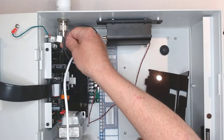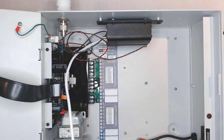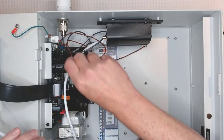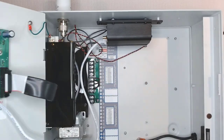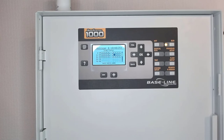Then connect the modem power cable to the power board at the port labeled COM3. Now take the other end of the ethernet cable and connect it to the port on the back of the display board. You can use the included gray cable clip to secure it if needed. Power the controller back up and the hardware installation is complete. With all communication methods, make sure the antenna and ribbon cable are connected before powering up the controller. Powering up without an antenna or ribbon cable will damage the device and void the warranty.